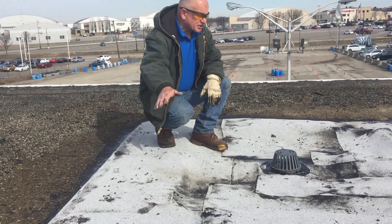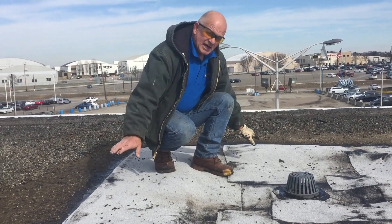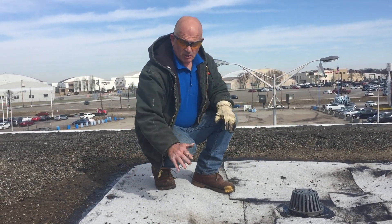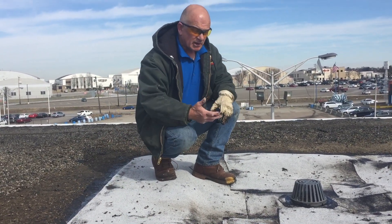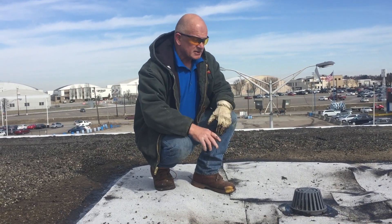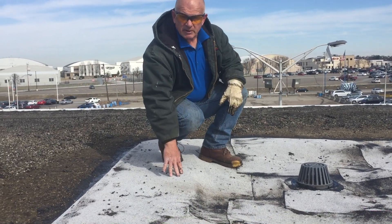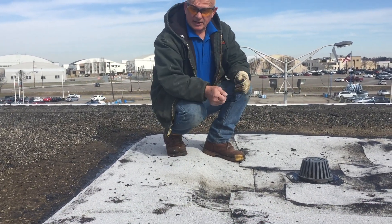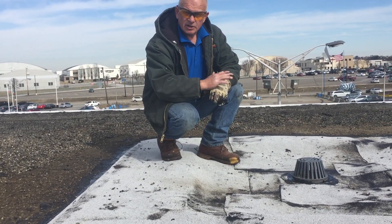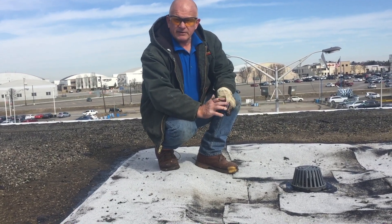So I made the transition to an old gravel roof, and I put a membrane and attached it to the drain, so it's all one piece. There are no more seams, no tar lifting up, no paper breaking up. This is good now — it's not going to leak anymore. This is not a torch-down membrane, this is a glue-down membrane, but I had to torch it, so it looks very ugly because it's white and black and tar and everything. But this is now a very good drain. It will never leak again.